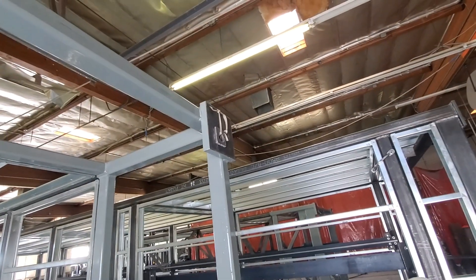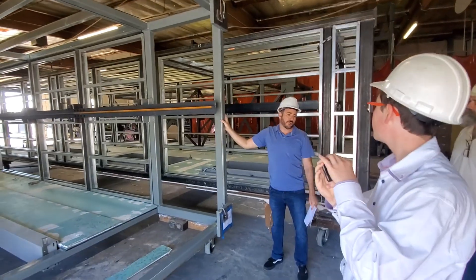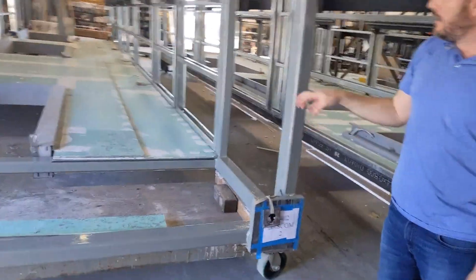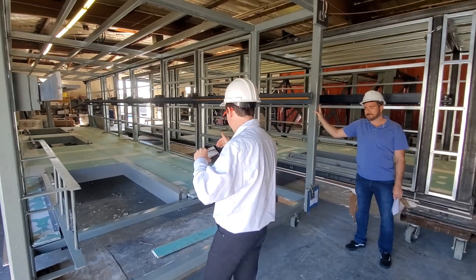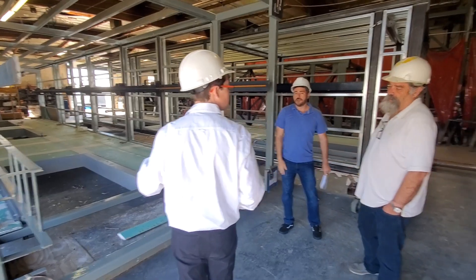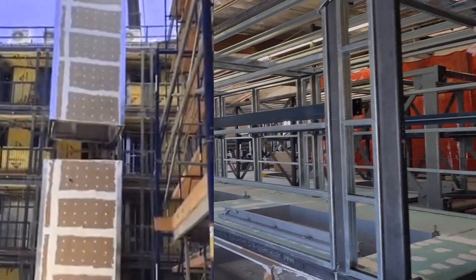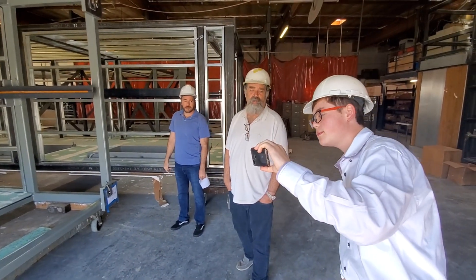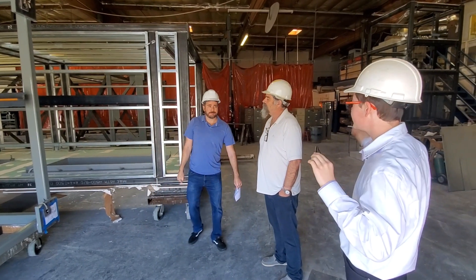Those are like the shoes of the elevator — this is dropped into the pit. It has anchor bolts that are embedded into the concrete, and the elevator drops in and catches those anchor bolts, then it's basically just bolted to the ground. There has to be a certain distance from the bottom of the pit to the first landing — the minimum is four feet. So we crane the whole structure at the job site, drop in the first section, drop in the second section, and bolt them together. The ladder is already in place, and we do all the electrical. Pretty much everything is done here besides installation.